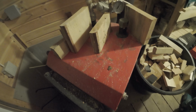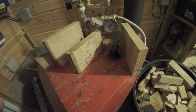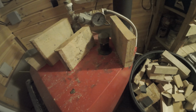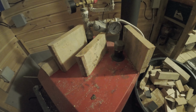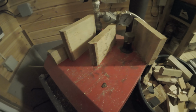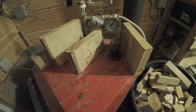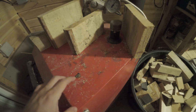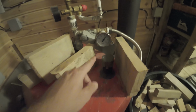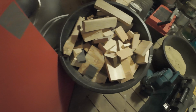So now the benefits of having like 1,000 liters of the tank: it accumulates heat, so you burn the wood, and when you wake up in the morning, it's still warm in your house. That's the one benefit. The second benefit is, just because it's heating up slowly, I need to burn this 5 times to get it from 30 to 80 degrees. That's a lot. You need to come and throw in again, and then come and throw in again.